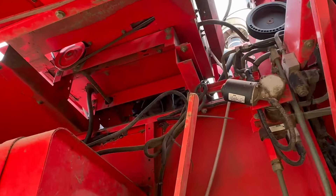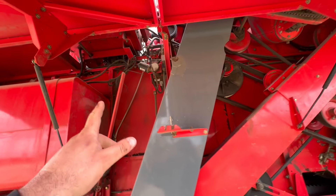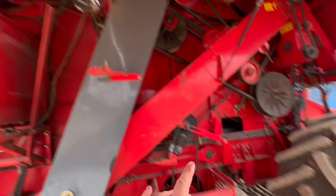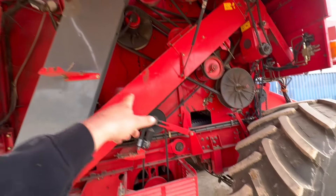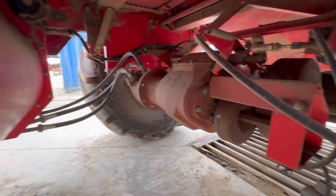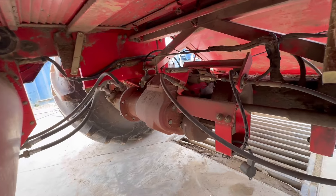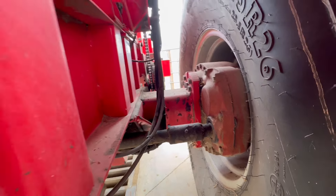With the engine running it can't go anywhere, because it's hydrostatic drive. It's got a gearbox under here but there's a hydraulic pump up there that feeds two big pipes which come down under here. Those pipes feed this big gearbox, and these shafts here turn the final drives to drive it.